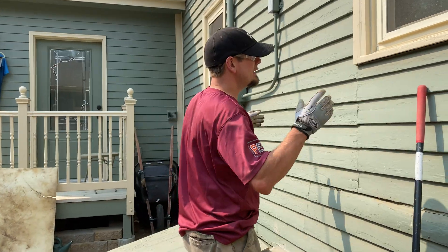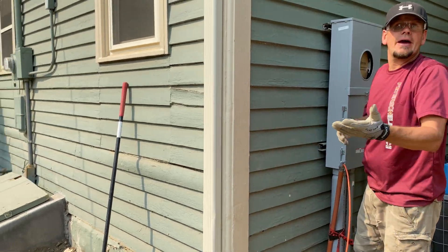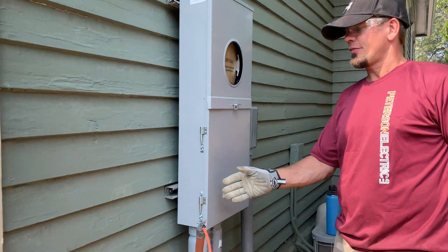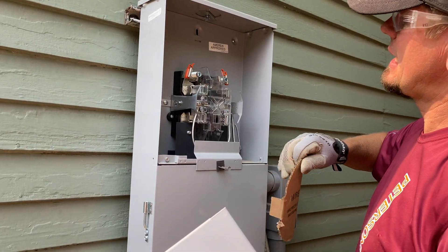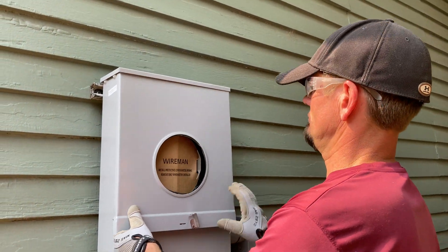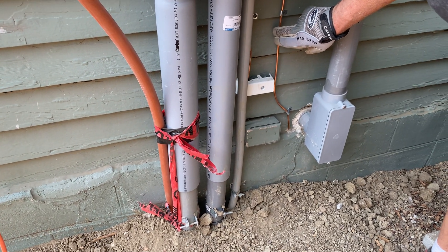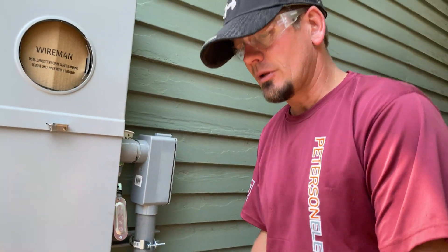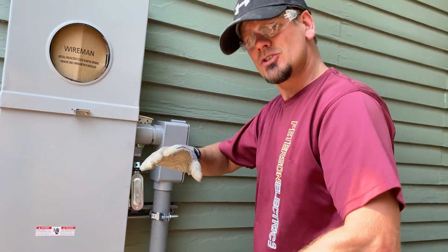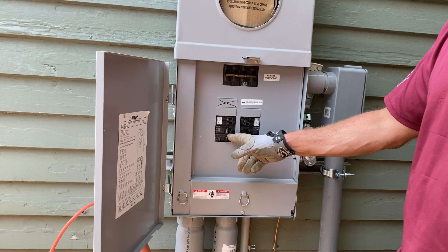Loveland would not allow any window within three foot to the edge. A lot of old houses have a problem with this. Fort Collins Power is not as picky, but Loveland is very picky. So right here you have to be three to five foot from the edge — edge of the gutter, edge of the house. The gutter's attached, so I use that extra two-and-a-half inches. We are right at about 35 inches, so close enough. Right here coming in, our bypass lever. There's a 200-amp main single phase. Our two ground rods were buried right here with our system bonding bridge bar and cold water to the basement right here. I left this strut long enough so I could use a mini strap to connect it. They really don't include the LB, so you don't want that to wiggle, so I just made that strut strap longer. All of that's already fed in. And then I gave them some power here.